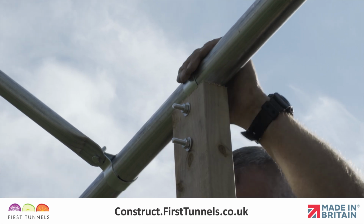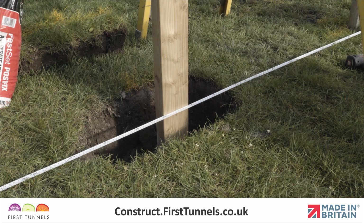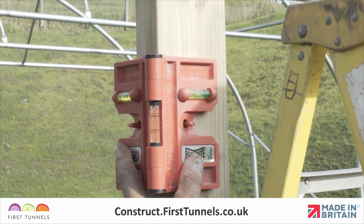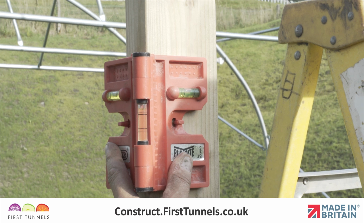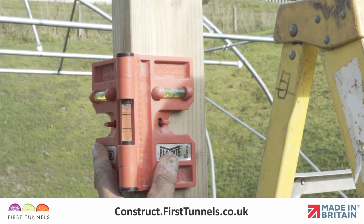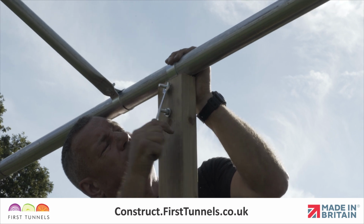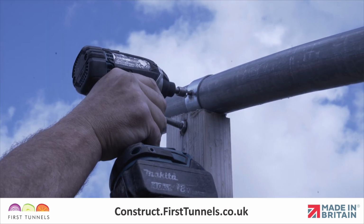When securing to the ground, ensure that the door frame post is positioned 220 cm from the central mark to the inner edge of the door frame post. It is critical that the door frame post is vertical. Use a spirit level on the front and side face of the post. Once you are happy with the position, tighten the nuts on the P-clip and secure the P-clip in place with a self-drilling screw.